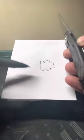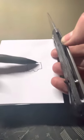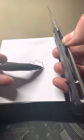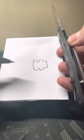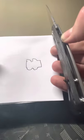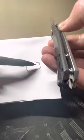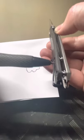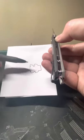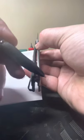One end is pretty much flat. And the other end, we'll call it kind of like a nipple sticking out. That's kind of exaggerated, but it's sticking out like a little bit of the inner cylinder there, just how it's drawn here. The other side's flat. This has the small shaft. I would imagine originally the side with a little bit sticking out was facing towards the carbon fiber, and the flat side was pushing against the clip on this side because the clip was on this side.